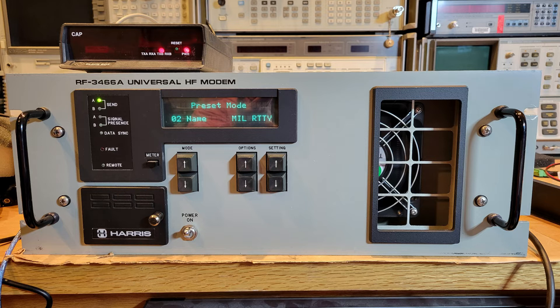The unit has two completely independent modulators and demodulators, allowing either two independent communication channels, or the two channels can be combined for diversity operations — either frequency or space diversity. The concept of diversity is that if you can send the same information out in two different ways, a receiving station has the best opportunity to receive a signal in its whole. For serial communications, this unit can be configured for RS-232 or other standards such as the MIL-STD 188C, but today we'll focus on RS-232, as that's what's most commonly available on people's computers and laptops.